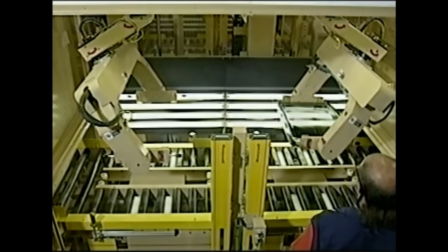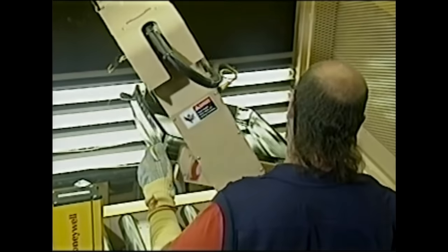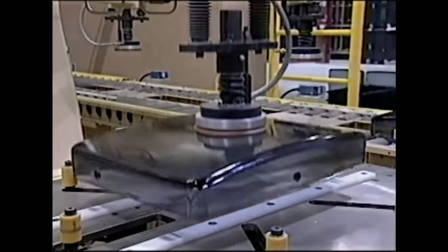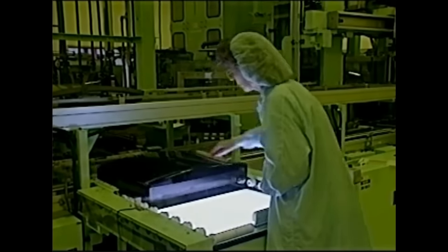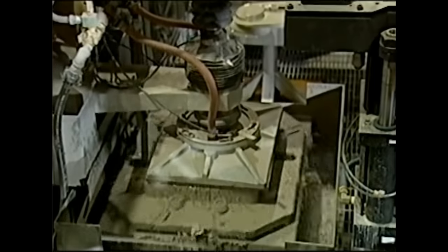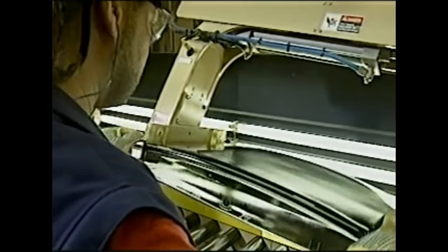In contrast, panel glass is heavy, weighing as much as 80 pounds. Panel glass also differs from funnel glass in two other key respects. First, the glass formula includes chemical coloring agents that give the screen its characteristic smoky tint to enhance the quality and brightness of the color TV image. Second, since the panel glass is the viewing area of the TV, it must be finished to the same demanding optical standards as camera lenses and eyeglasses. To achieve that precision, the panels are subjected to a three-stage polishing operation. Polished panels are then inspected by a human operator to detect any physical flaws or variations in color and clarity.